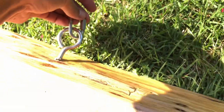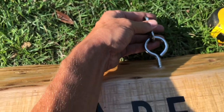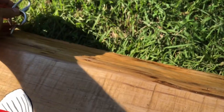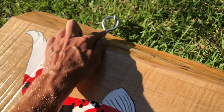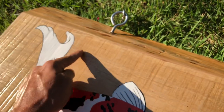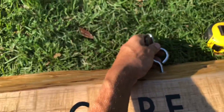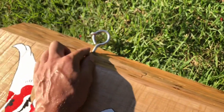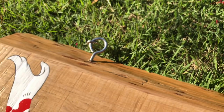And also with the hardware here, these are quick links, stainless steel quick links. And they're really nice as far as, this will give me a little bit of leeway. If I'm off a quarter inch, you won't see the difference. And it's all stainless steel, so we're here near the coast, so we have a lot of salt in the air. And even if you don't have salt in the air, the others will rust over time. Even the galvanized will tend to oxidize, and then you get streams going down your artwork. So it's really important to get these. These are more expensive. It's considerably more. For these six pieces of stainless, it cost me almost $40, but it's lifetime. I'll never have to worry about it again. So sometimes also, you know, time is money. So do it right the first time.